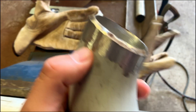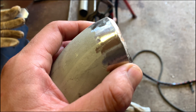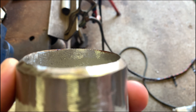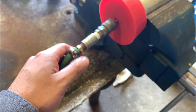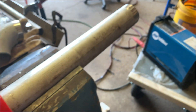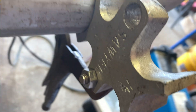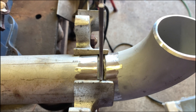We're going to be welding this 90-degree fitting on there, and you also want a feathered edge. Clean the outside, clean the inside — probably about 3/8 of an inch. Feathered edge, guys. We're going to be using our purge plug and purge hose. I'm using some Sawyer clamps — two-inch — to fit up my 90 fitting onto the pipe.